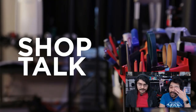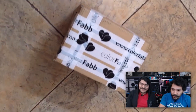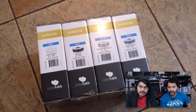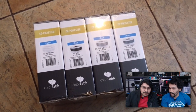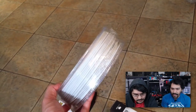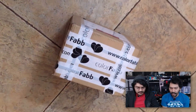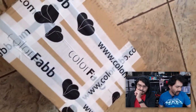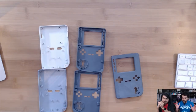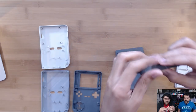Shop Talk: we're testing out new materials this week. Just got in, fresh from the Netherlands, ColorFab's new material NGen. We got some light gray, black, silver metallic, and dark gray to test out. We're testing these on the FlashForge and the Ultimakers. First thing we noticed when unpacking: it doesn't include the desiccants that usually come with PLA — it should be able to absorb less moisture from the air. Since we do electronics here, the very first test we're doing are enclosures.